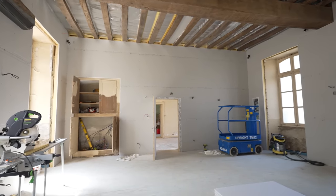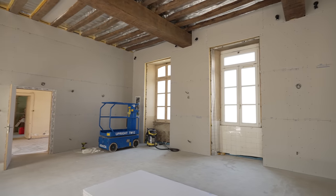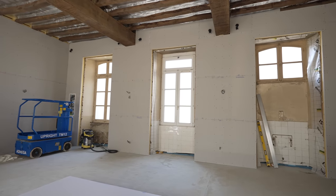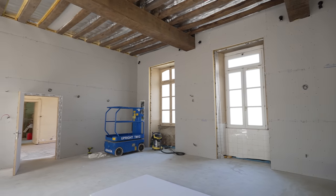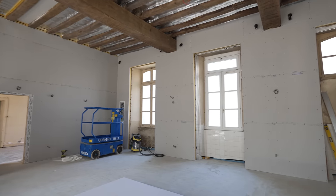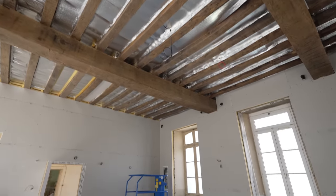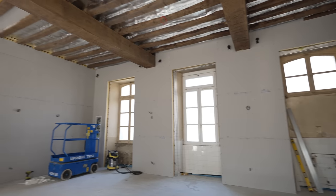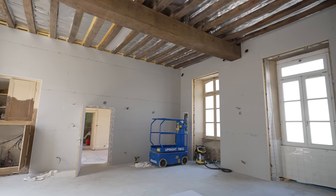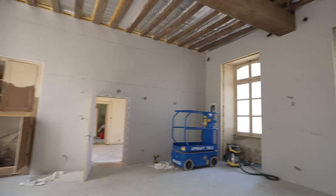While we're still in the kitchen — we're still waiting for the windows. Potentially we have a plasterer on board who is going to come and do loads of work to get this kitchen immaculately finished. We can't really do anything in here until the windows are in. Maybe a bit of ceiling work we could do, but ideally I want to get the windows in first, then finish the ceiling and have the whole room plastered rather than just tape and jointing everything — you'll get a much better finish and stronger bond on all the joints.